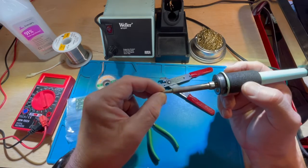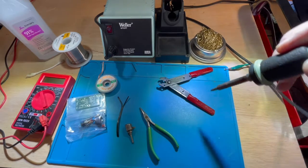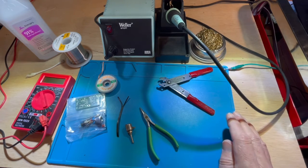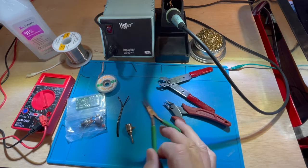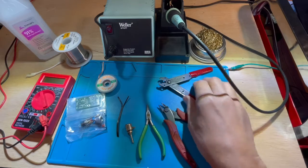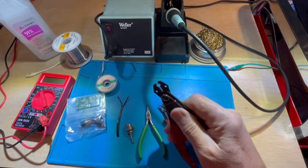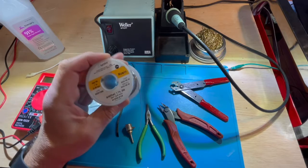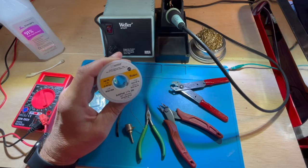As explained in the slide deck, these soldering tips do indeed wear out and need to be replaced from time to time. The basic tools used here on the bench for soldering are the needle nose pliers, edge cutters for nipping off the component leads when in the circuit board, and stripping back wire, which will be one of the first things that we do in the demonstration. The solder, of course, is right here. I use 60-40, the percentage of tin to lead.